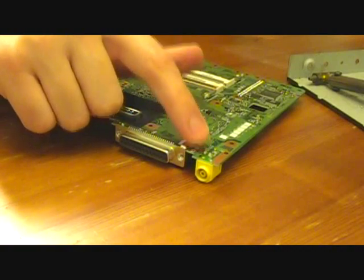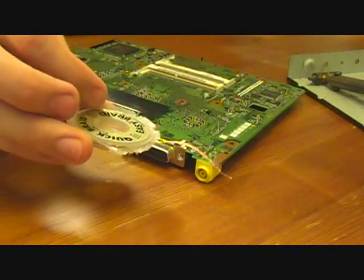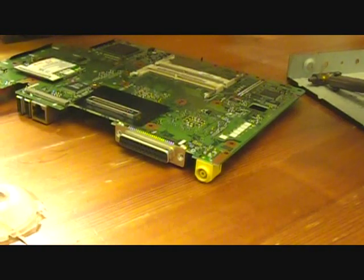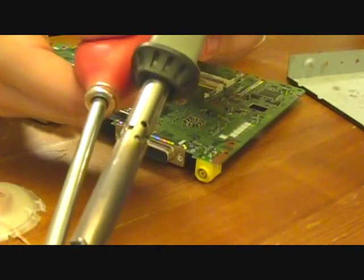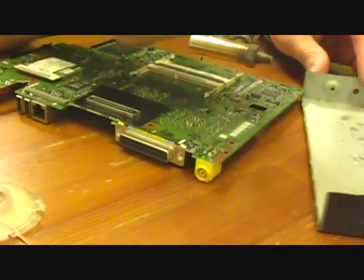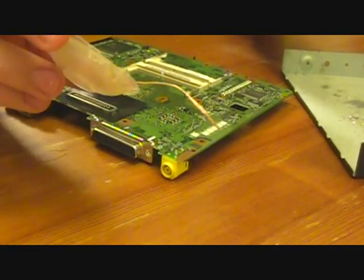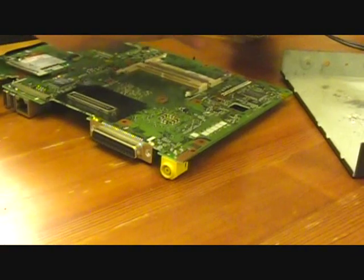To desolder it, you can do it with one of these braids — basically you stick your soldering iron, get the solder hot, and then you touch this and the solder sticks to the braid instead of the jack. Or you can get a desoldering iron — it's got a hollow tip on it, so you squeeze the bulb, put it on there, let go of the bulb, and it sucks the solder up. Then I come over here and I spit the solder back out on this little metal thing. I much prefer the desoldering iron; I'm not very good with the braids.